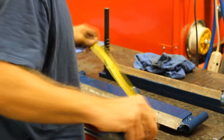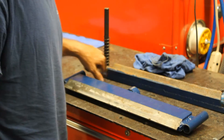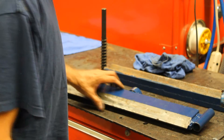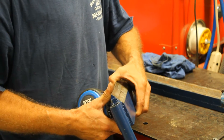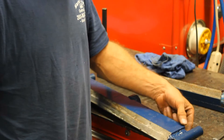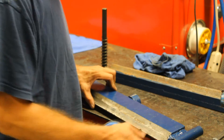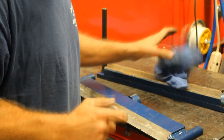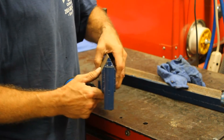For the overall width of this thing, Harbor Freight has a newer model of the press, so don't take this 22 inch length for gospel because it could be different on the newer Harbor Freight press. This wedge I made on the milling machine. You don't have to do it this way — you can put a half inch or three quarter inch piece of flat steel and either grind a wedge on it or weld an angle iron on it. The problem with welding an angle iron on it is you only have a 90 degree, whereas this here has a 65 degree angle on it.